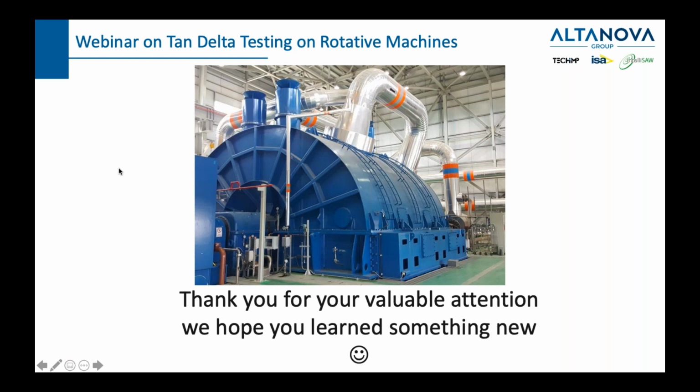Through the test, if tan delta value changes, what is the probable reason? The reason for this is that as the voltage increases, the water molecules and also the molecules of contamination inside the electrical insulation get even more conductive. And because they get even more conductive, the tan delta increases.